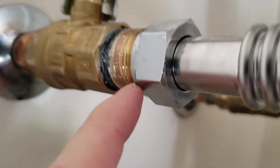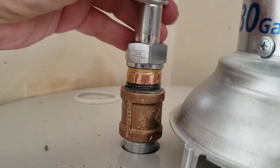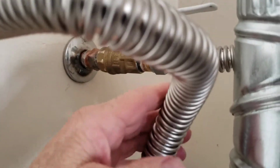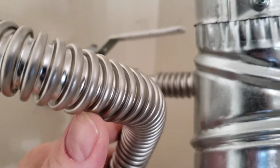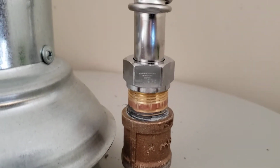From there, we go to solid brass and stainless steel. So these flow very well. No iron pipe in our installations. Comes down to a little brass coupling and nipple. And then these are Falcon stainless steel, full 3/4 inch inside diameter. They're the largest in the industry. Also the most expensive, but that's what we like. That's what we use. So both sides are the same. Falcon stainless steel connector down to brass extension. So you're all good there.